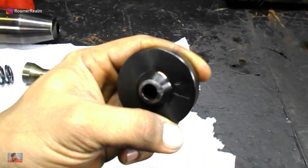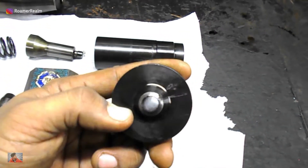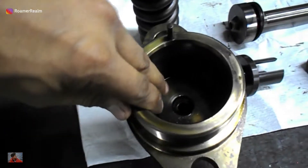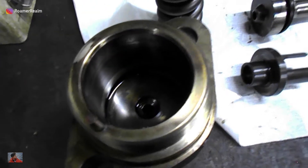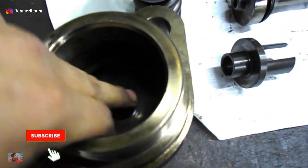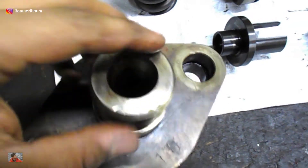About the thrust spindle — the old one was damaged beyond repair so I'm going to use a new one. A few scratches can be lapped and polished but damage that's too deep shouldn't be repaired for reuse. The small discs that you see are for adjusting the injection pressure. Next is the injector head — it's really important to inspect the inner surface where the O-rings are sealing. Many times this surface develops a step formation on the inner walls which eventually leads to an oil leak. Also check the condition of the face where the non-return valve will be sealing against — it should be smooth and without any cracks, surface defects or dents. Pay attention to the threads and inner surfaces as well, because this is where the high-pressure fuel pipe will be connected when the injector is in operation.